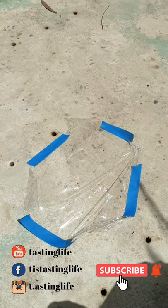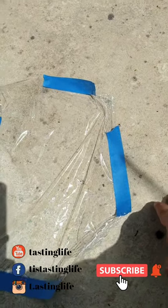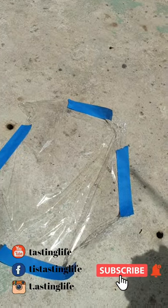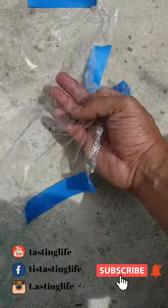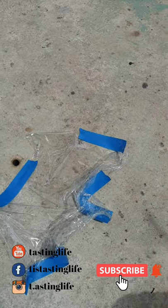One thing you've got to care about before you paint the primer is making sure your pool is actually dry. What I've done is stuck a bit of cling wrap on the floor and left it for a few hours. There are actually tiny droplets of moisture on the inside, so I probably shouldn't paint just yet. I'm going to give it till tomorrow — at least the floor. The sides I can get away with, but the floor I'll leave for another day.